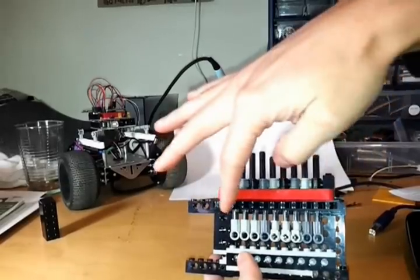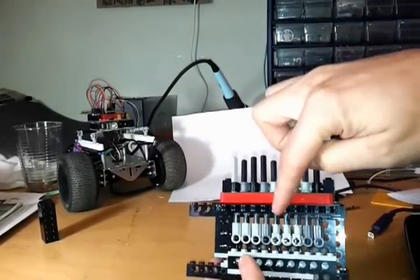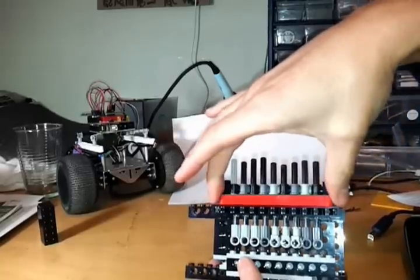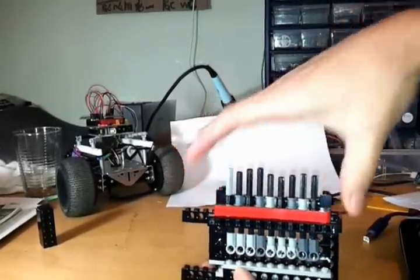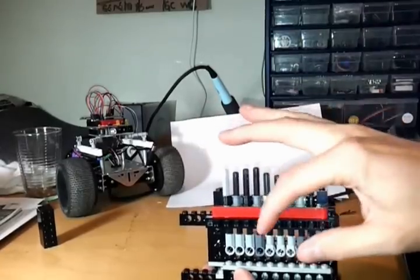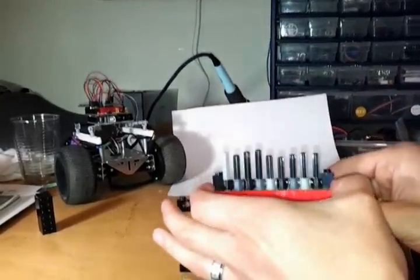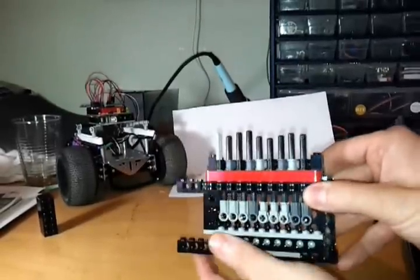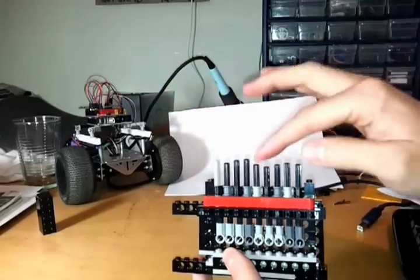When they're uneven like that, there's a bar here and the pins go all the way through the red bar and into this one. The idea is that the whole mechanism would turn except this red bar, and since the pins are going through into that black part, it would prevent the system from turning — that's the lock. There would also be another bar at the top, and if a pin is too high it would go through that too.